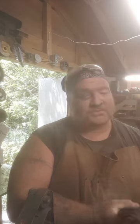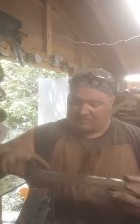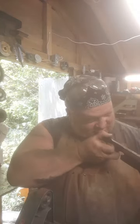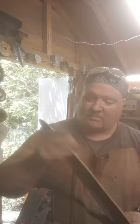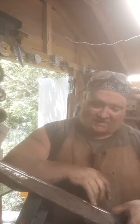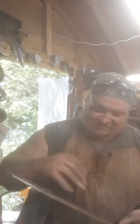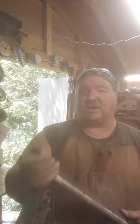It feels like a long time. An hour just grinding something. It takes it out of you. But, so we got the fullers in. They're mostly all right. I like to do the fullers before I ever grind and clean up the sides, because then if I've got little nicks where it jumped off the wheel, it's easy to clean it up.